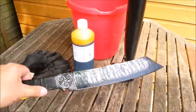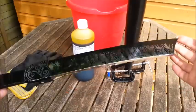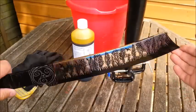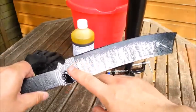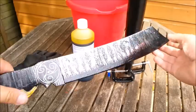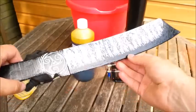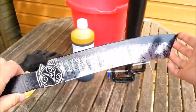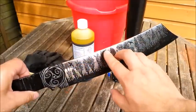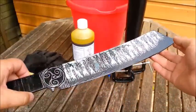Today I'm going to be having a go at knife etching using acid. The principle is that by using acid you can actually burn away exposed metal. To get a nice pattern, you paint the parts of the metal that you don't want the acid to attack or corrode, using acrylic paint — nail varnish is perfect. Then you dip it into an acid bath, clean it, re-dip it and complete the process until you've corroded enough of the exposed metal for the contrast. I've never done it before, so it's the first time for me.